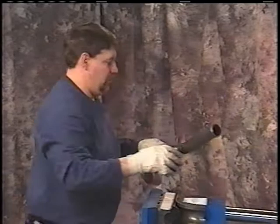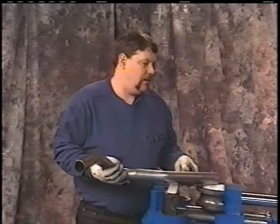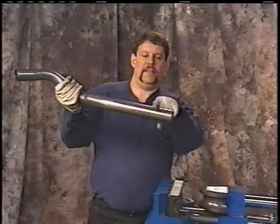Okay, we're going to back that ram back in, take that short section of tubing out. We now have a pipe. It did say on the card, on the cut at 30, down below, it says saw cut to suit appearance. So what you want to do is install this tailpipe, which slides in the muffler. You want to make that mark in here wherever that quarter panel is.